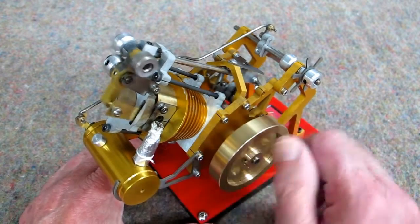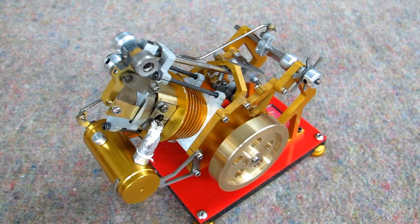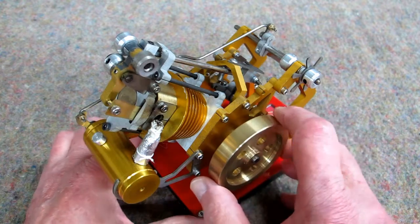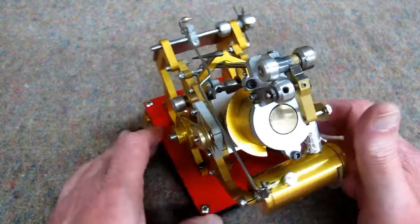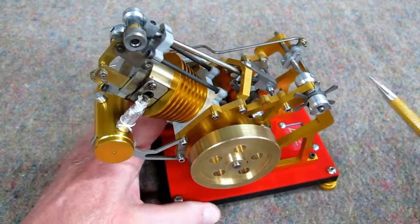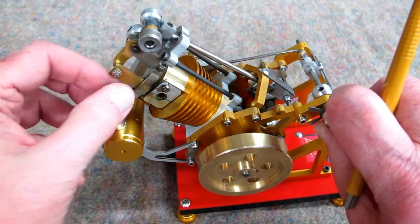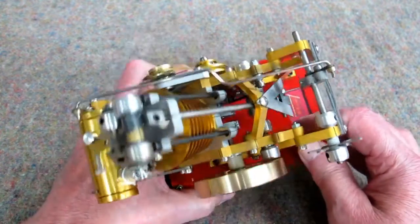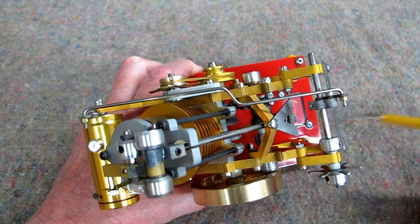I get a fire on it and just keep flipping it until the cylinder gets hot, which can take quite a while — five or six minutes. This will not run until the cylinder gets hot. Once it's running, everything gets hot: the plate and everything will start getting quite warm. When the tank is empty, you'll notice the wick glowing red. Blow it out, turn it over, snuff out the burning embers, and save your wick. Let the whole thing cool off before refilling. There are some bits of nylon or plastic in here — if it gets too hot, that could be detrimental.